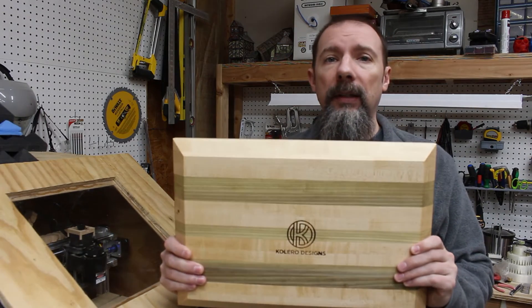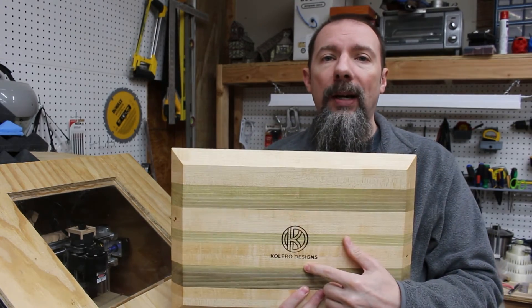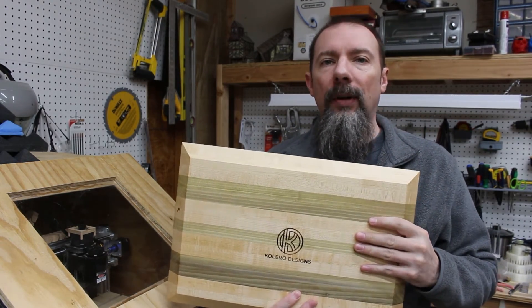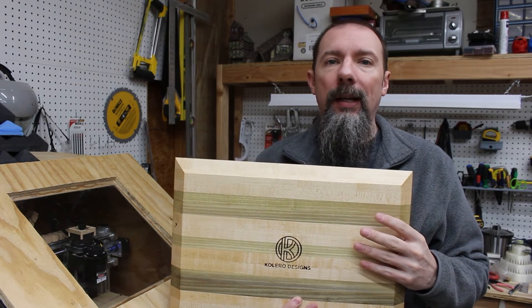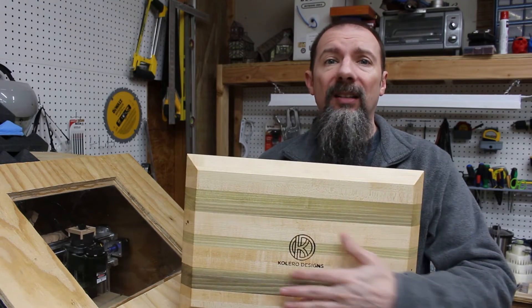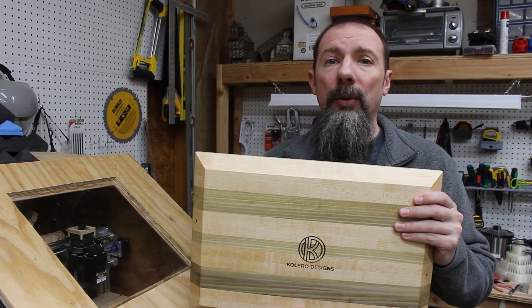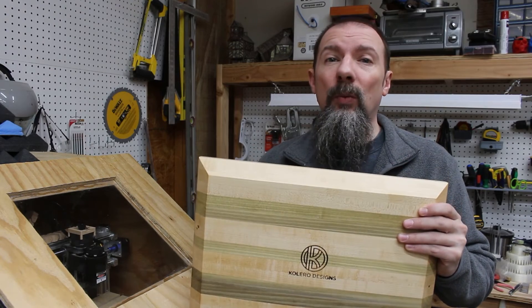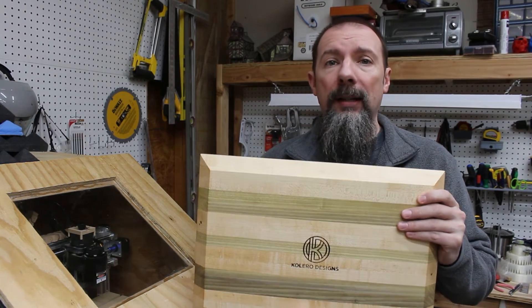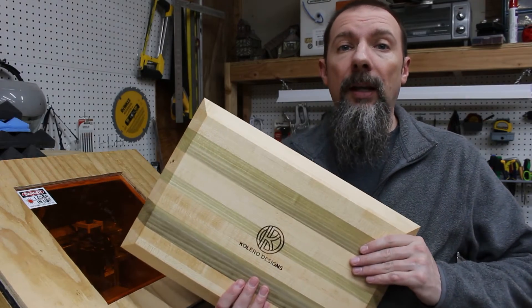A closer view here — results? Not bad. Painting the Borax solution on, you can definitely see the color change in the wood. But I don't know if it's necessarily worth it, because it's just going to come out over time and it's only going to be as dark as the wood was brown. I'm going to hit it with a 120 to see if that cleans it up, then pop the grain to a 220. In the end, I was able to accomplish what I wanted with my laser, which was engraving my cutting board. If I were to do this again, I would not use the Borax. It's a little light. All the Borax does is make a bunch of soot, and then it wipes away and you're left with not as nice an engraving as if you hadn't used it. Maybe I did something wrong — I only did this two or three times — but the few times I did it, it really didn't work well for me. Going forward, I'm not going to use Borax, at least not on cutting boards.